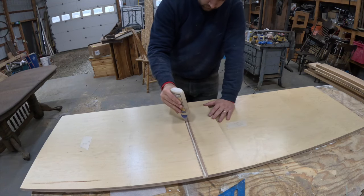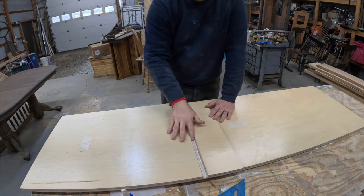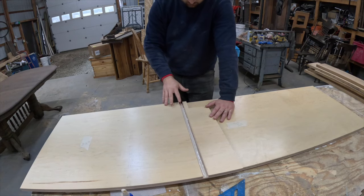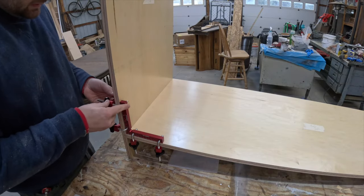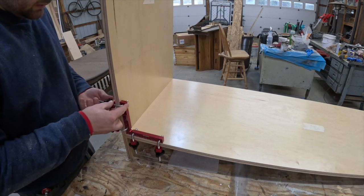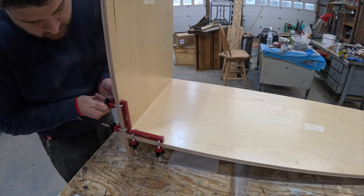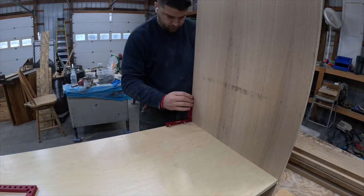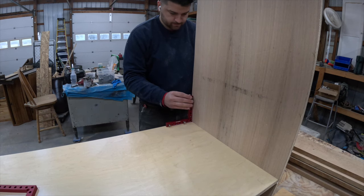I assembled the box together using some wood glue, putting a generous amount in the dado and making sure that the bottom rail seats firmly into place. I just picked up these corner clamps that are made for building cabinets — they have pegs that lock into the 90-degree bracket and then clamp down to the cabinet box to ensure it's perfectly square. I have links to these as well as all the other tools I use in the build down in the description.